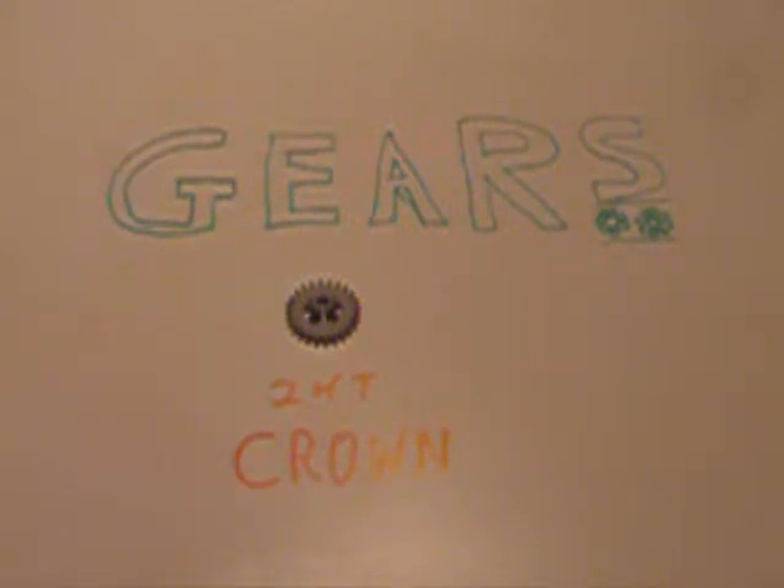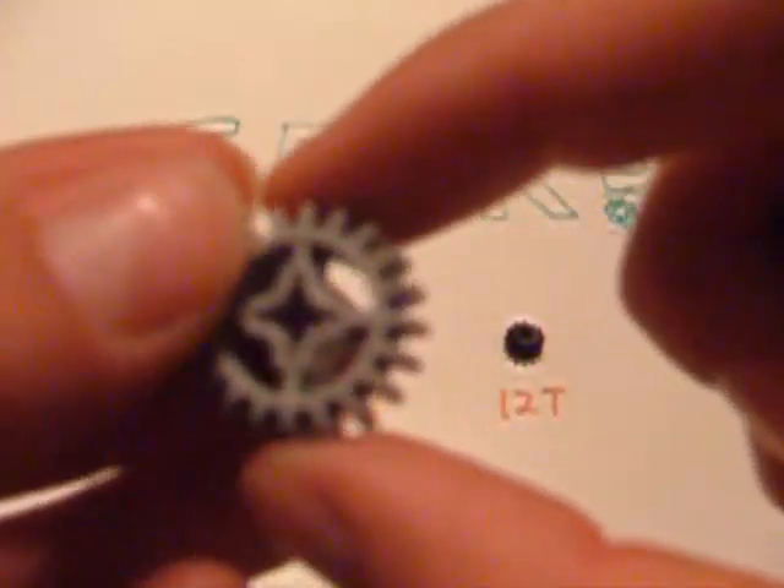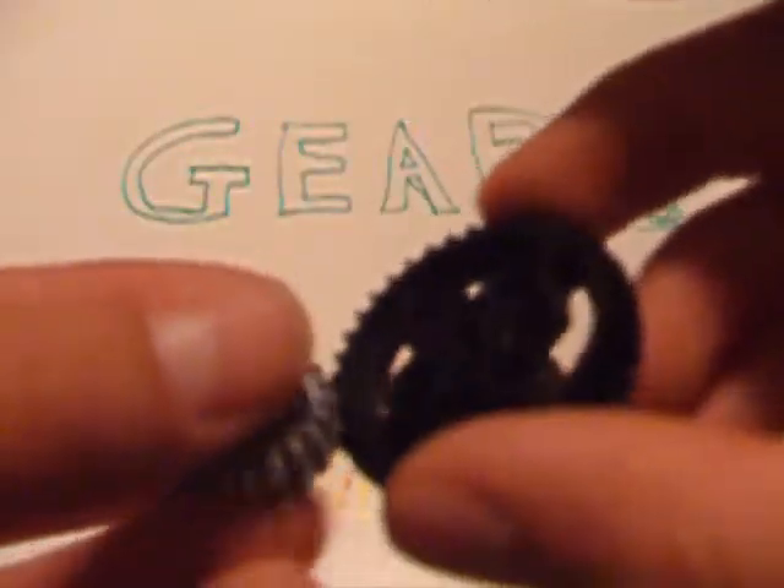What if I told you there were even more ways to do this? Let's take a look at the second class of gears: the bevel gear. Bevel gears are used in a similar context to crown gears — they are designed to redirect motion. As you can see here, the bevel gear is pretty similar to the average straight-tooth gear; you can compare the 24-tooth to the 20-tooth bevel gear. However, while on the straight-tooth gear the spikes shoot straight out, on the bevel gear the teeth are rounded, so they can mesh at all different angles.